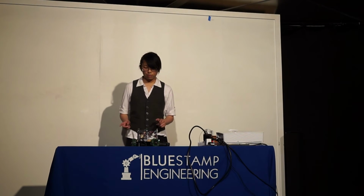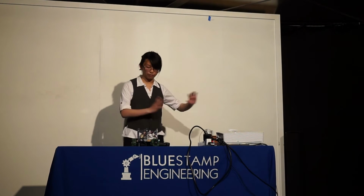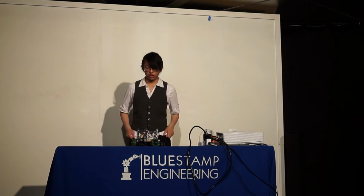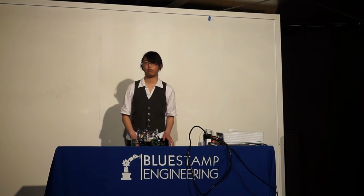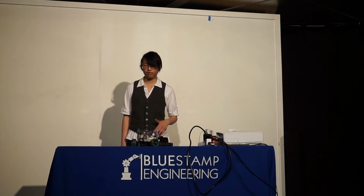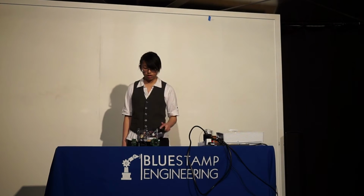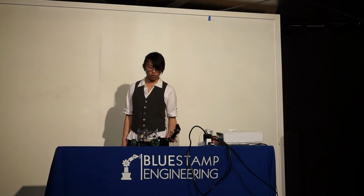Coding-wise, trigonometry, not easy on me because pre-cal is not for summer. But yeah, the hardest challenge would be when the robot started glitching out and moved, even if I wasn't touching the controls. I found that it was because the receiver for the controller would disconnect and reconnect, and every single time it reconnected, it would send a signal through the analog stick, and since the analog stick is what controls the bot, it moves.